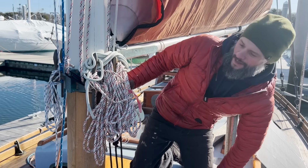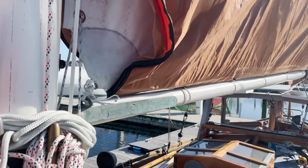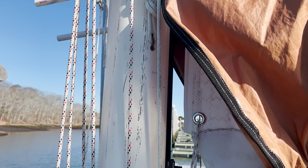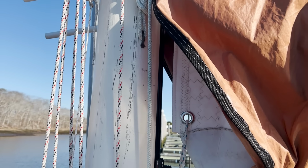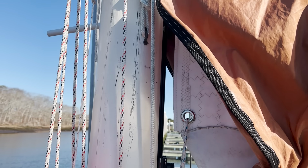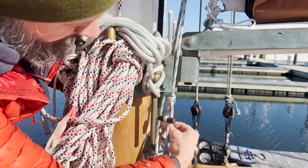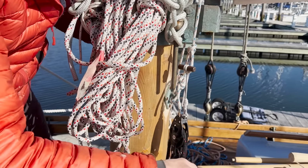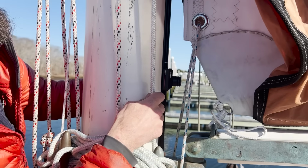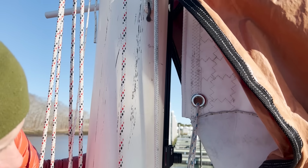And if you watch that luff, I'll give this a bit of a tug and you should see it tighten up a little bit. None of these screws are totally final, so I'm not going to pull on it real hard. You can see how this point has moved down. And now we've got slack going to the pad eye. And this is pulling back and down on our sail. And that's getting this luff to be tighter and tighter.